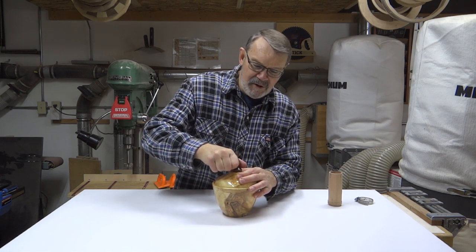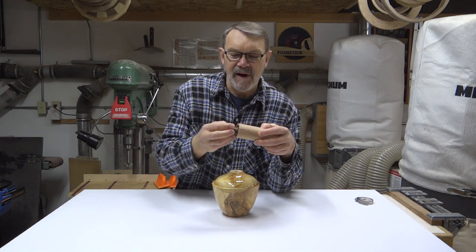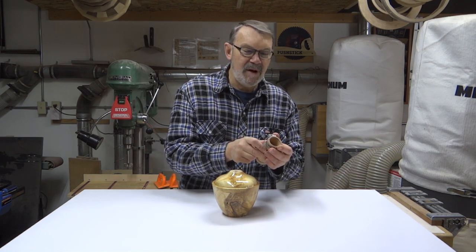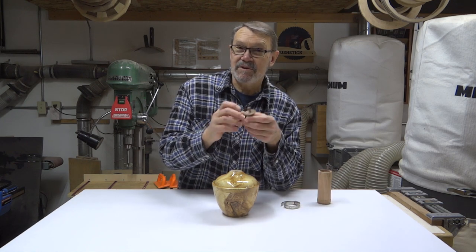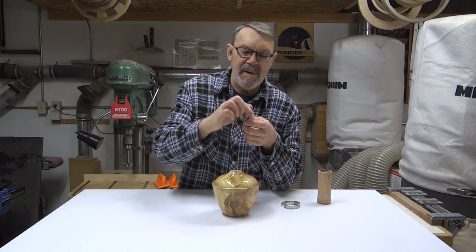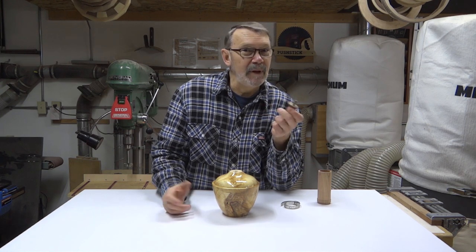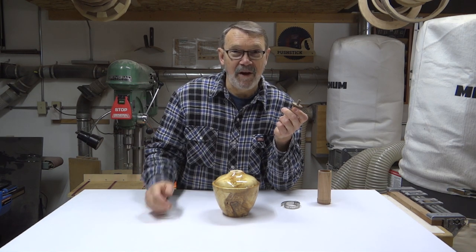So now what I want to do, I've made this piece, and this will fit in there. Then I've made some slots. I'm going to put this hose clamp around there, tighten this in there, and then try, without screwing everything up, to make that a little bit concave. I'll put some masking tape around here to protect it a little bit, take it over to the lathe, and do that. Next and hopefully last step before I glue this thing in here.